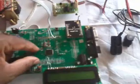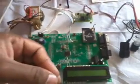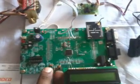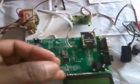UART0 in LPC2148 is configured as ISP, in-system programming, meaning this IC is a fixed IC. It is not removable. We can dump the program 1 lakh times to test it. It's an ISP, since internally the IC is programmed for in-system programming. That's why this switch is called ISP and the remaining switch is called the reset. When we want to dump it, press and release the reset, and the program will be dumped onto the microcontroller. When the program is dumped, we have to press and release the reset. The program then runs continuously in executable format.